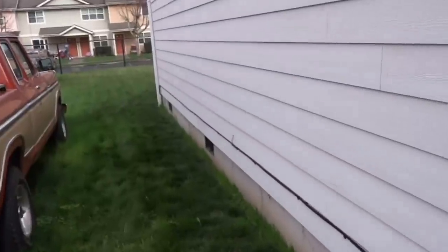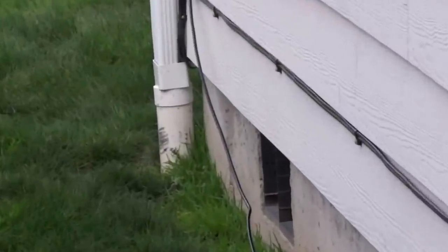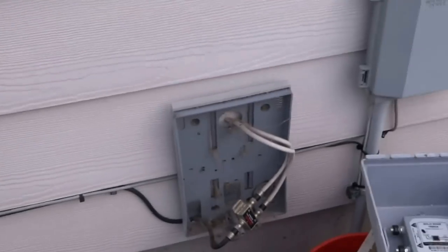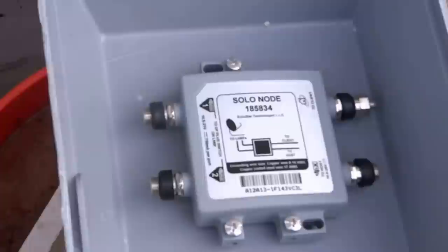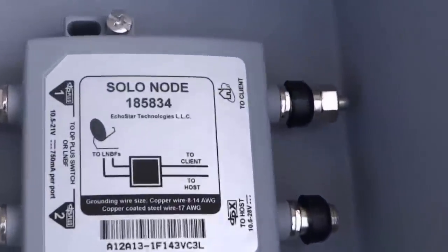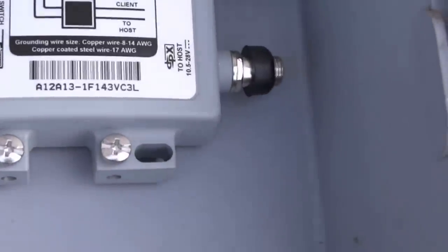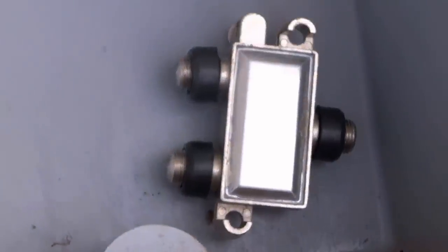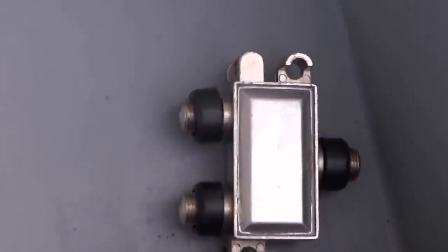It's always better to have too much wire than not enough. It came down, went around the gutter, came up and ran that line behind and up into this box where we've got two wires. I'll proceed to hook up the node. You can see I capped off the client side so I can do the download on the hopper. I'll have a jumper from the client to a two-way splitter, and an integrator hooked to this third line and into the splitter, which goes to the room where the super Joey is.